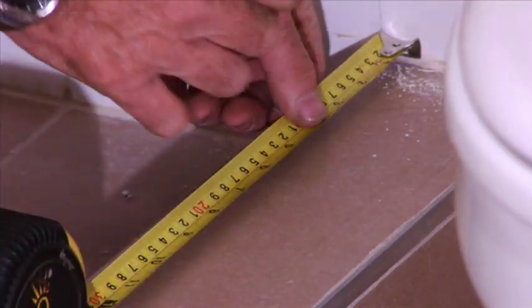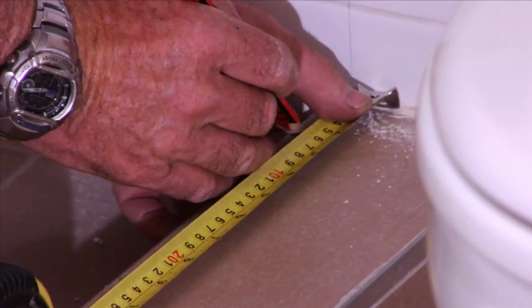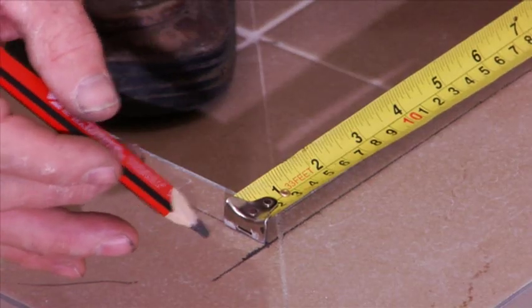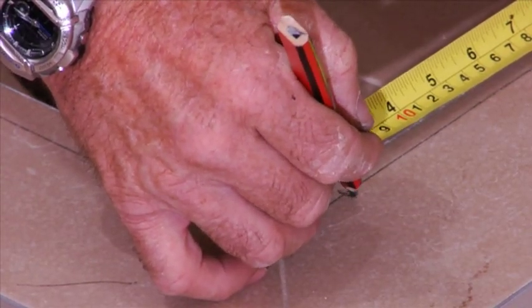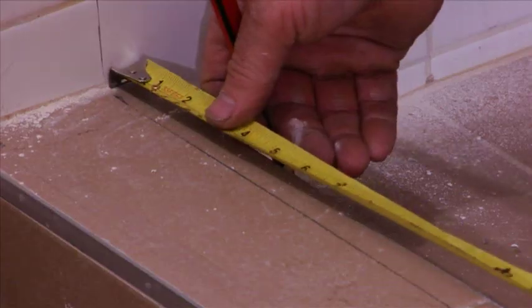On the base of the fixed panel glass centre line, measure out 50mm from the wall and make a mark — this is where your first clip will be positioned. Then measure 100mm in from the end of the fixed panel line. This is for your second clip.